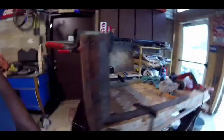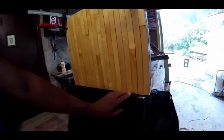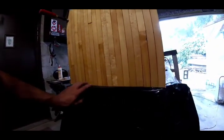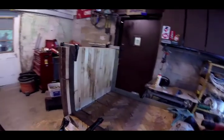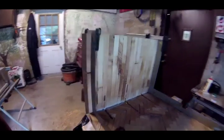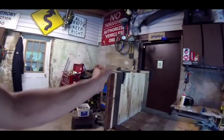And used a rubber mallet to work the miter in. Get it as close as I can. If I can't make it look good enough, then I'll router it over a little bit. But pretty much got it clamped in here. I'm gonna leave it for about 24 hours and let these lines dry up, and I'm gonna put trim pieces on the sides.